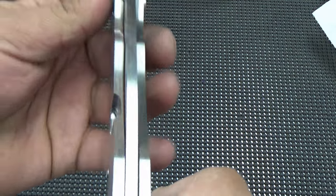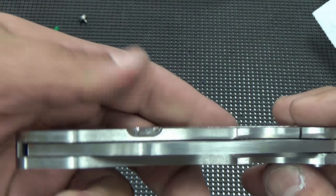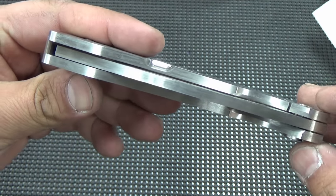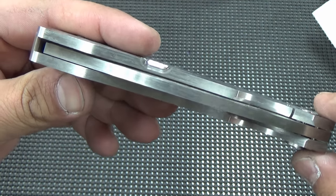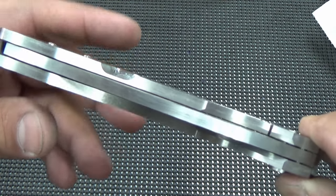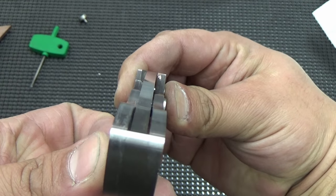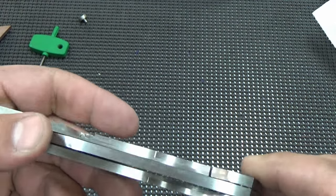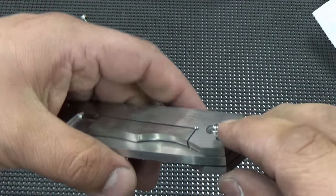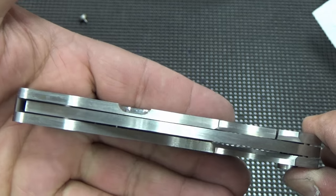Just as a note — you're not going to know what your centering is like until you tighten the pivot. The blade might just be kind of laying there, but if I squeeze the pivot side, watch where the centering is: it looks like it's off center, but as soon as I squeeze it as if you tighten the pivot, now it's nice and centered. So don't freak out if you're touching the scale and you don't have a pivot in — it just needs to tighten and align.